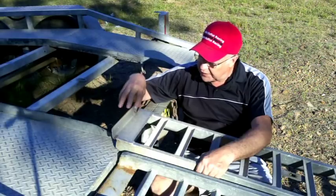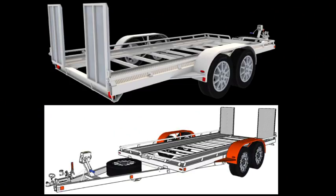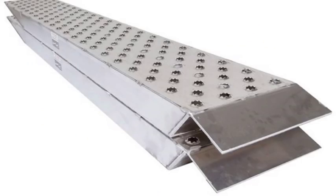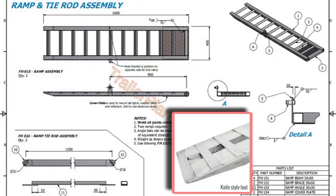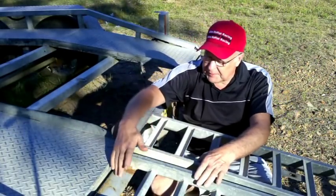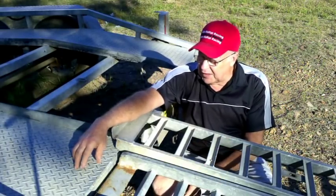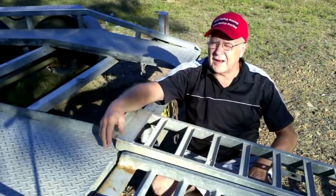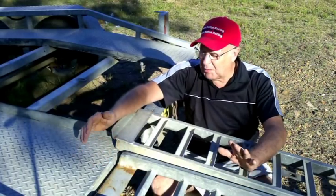There are as many ways of attaching car ramps to trailers as there are guys around the world building them. I am dead against car trailers that have their ramps hinged up high and out the back — it's just a recipe for fishtailing. Some guys have a sheet plate that goes over the top with a bolt in it, but I don't like that setup. I prefer a system that just clips in and clips out so you don't have to worry about fastening anything while you're using it — simple but strong.